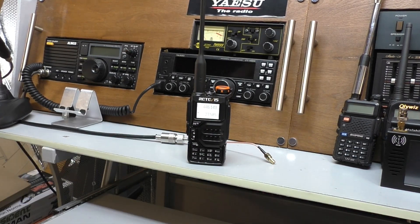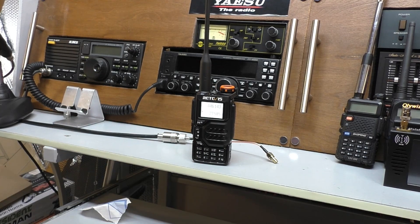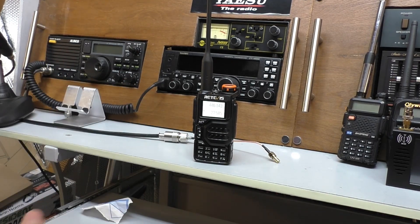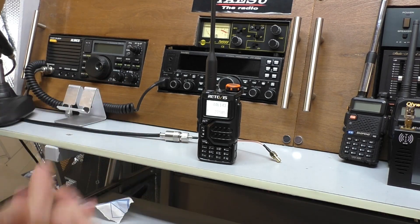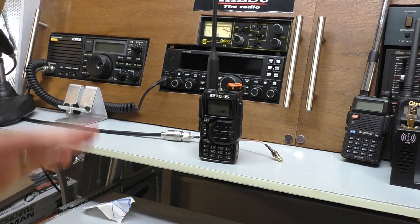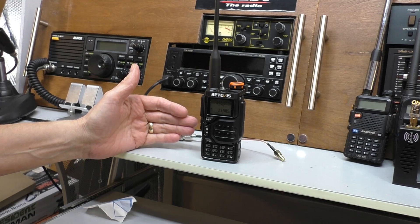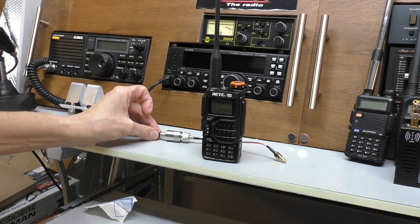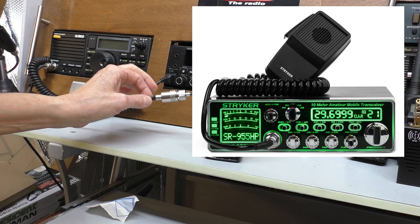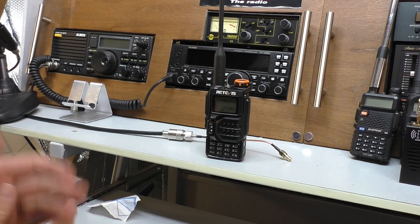Look, I can persevere with that — Rome wasn't built in a day. Maybe I'll go away and actually read the manual like I should have done. Slap on the wrist from old Fred. But anyway, I'm going to call it a success because the sideband is working — it might need a little bit of adjustment. What I might do on the next video — probably a short midweek video — is carry on tuning and see if this will go up to the 10-metre band. My antenna, although not really tuned for 28 MHz transmit, should receive the 10-metre band, and it'd be interesting to see if the radio can receive that.